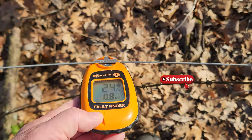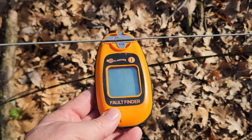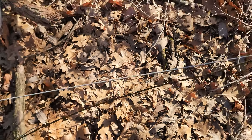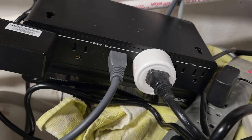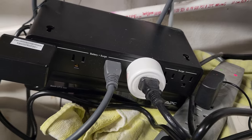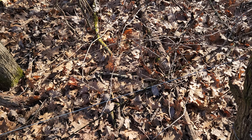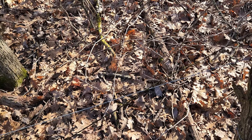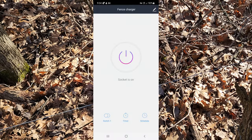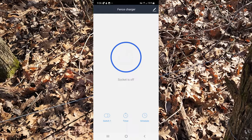I'm going to have to turn the fence off. The way I turn the fence off is I have my fence charger plugged into a smart plug in my house that's connected to Wi-Fi. I have an app on my phone and I can go in and control that plug. So if I'm out here checking the fence and I need to turn it off, I just go to that app, pull up the fence charger, turn off the smart plug, make the repair, and then turn it right back on.